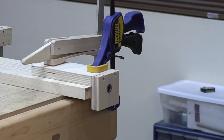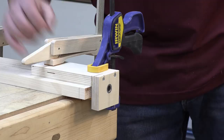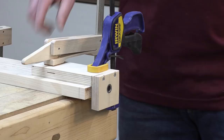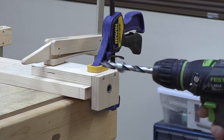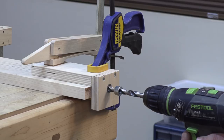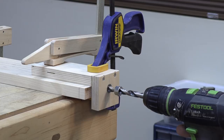I just used a flat table for stability, a couple cam clamps to hold that in place, also holding the perfectly lined up jig that I made for this, lined up on the end. The key thing is the top of the neck is facing up. The seven-sixteenths I need is from the top, not from the bottom — that would be a really bad mistake. With the stop collar in place, I can just run that in and slowly bore that hole. Chips aren't going to eject as well through that bushing, so I'm going to push in and pull out in order to get some of those chips to eject so that it drills a little bit better.